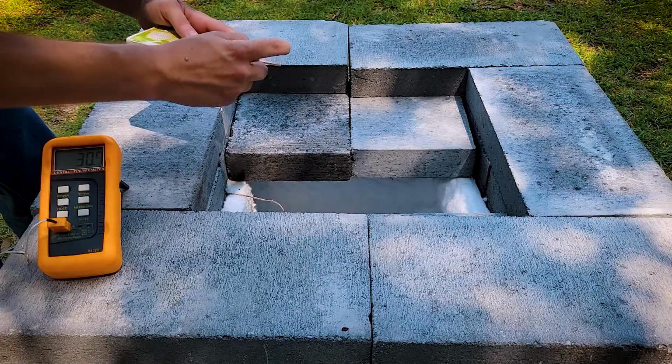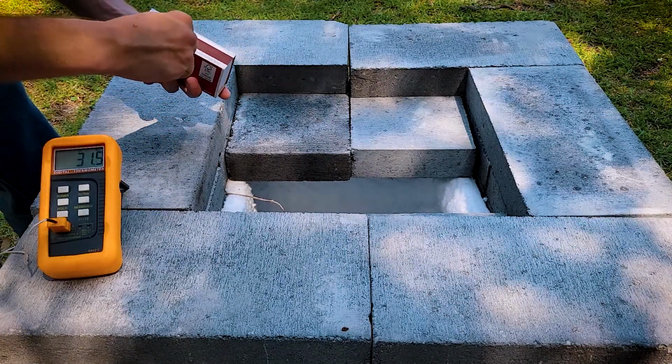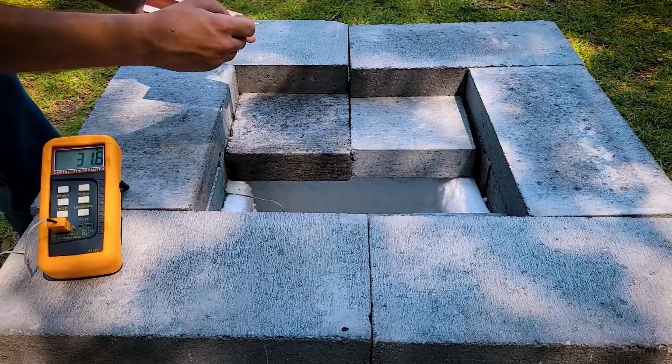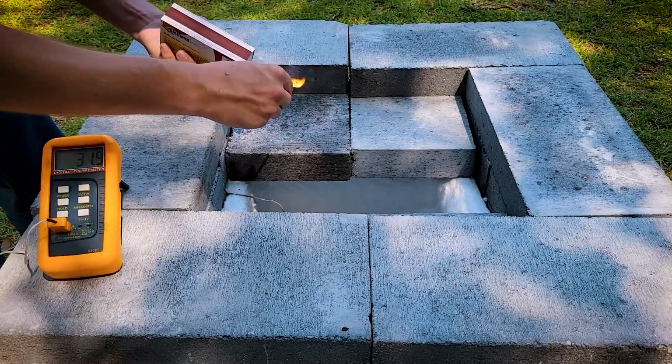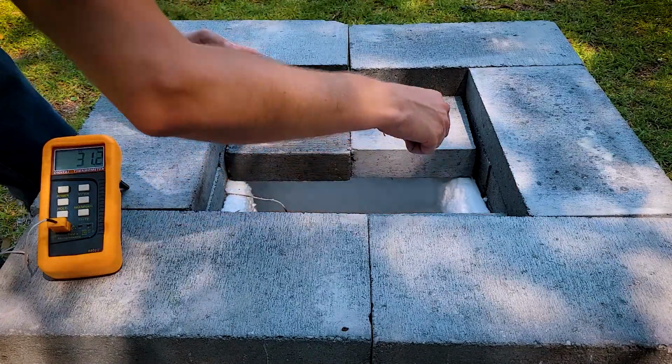Heat trials round 2. Let's see if we can't beat 140 degrees Celsius. So right off the bat, obviously we have to get this thing going. The best ignition process I had coming out of the last one was to make sure that the gas valve was closed, and then open the master gas, fully close the mixture, and drop a match in, which apparently lighting that match is the hardest thing in the world for me because I could build the rest of it, but I still can't light a match on the first attempt to save my life.